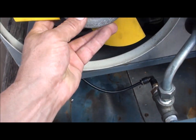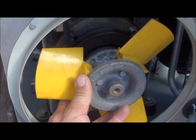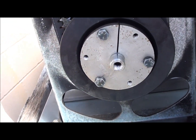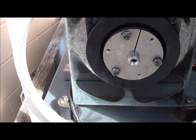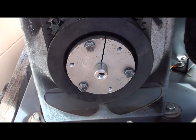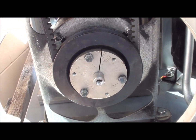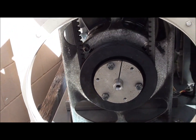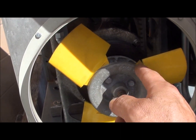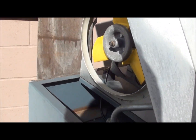I was looking at the old fan arrangement again, and I thought this thing kind of butts right up against the bolts — not the greatest — but I think I can get by without the spacer. So I actually drilled and tapped — painstakingly — the center of this motor shaft for three-eighths. Man, that shaft is some kind of hard shaft. I actually broke the tap right off inside the thing; took a while to get that out. But it's tapped for three-eighths, and I'm going to put the old fan on here. I tried this and it works really well. It's on there, and I didn't even put a locknut on because the shaft's turning this way, the nut tightens that way, and everything should be fine.